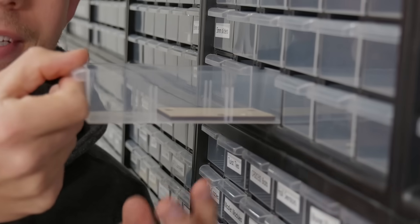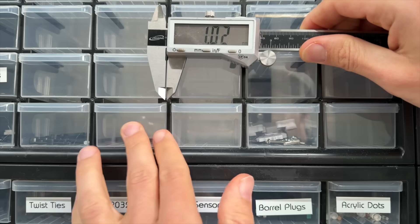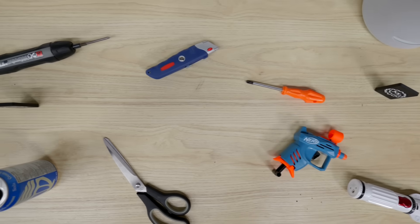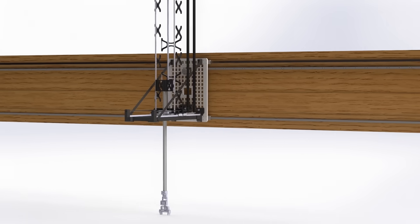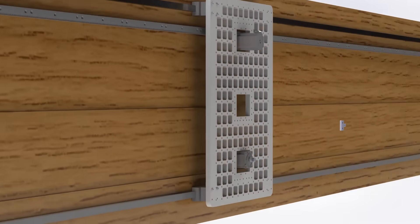For version one, the goal is simple: can I build a robot capable of pulling these drawers off the wall — but more importantly, putting them back? We're going to need one millimeter accuracy for that precision, and a second goal of tidying up tools on the workbench. The stretch goal is to build a robot strong enough to hold my weight. Let's break it down and tackle one thing at a time, starting with the part that terrifies me most: the x-axis.